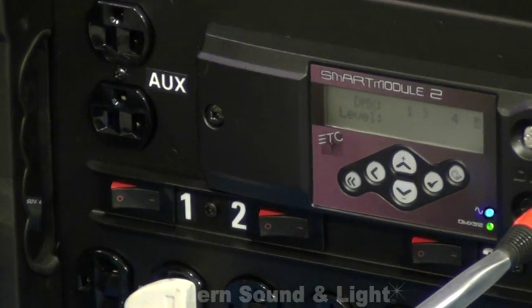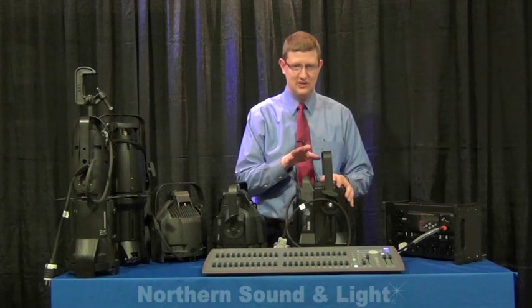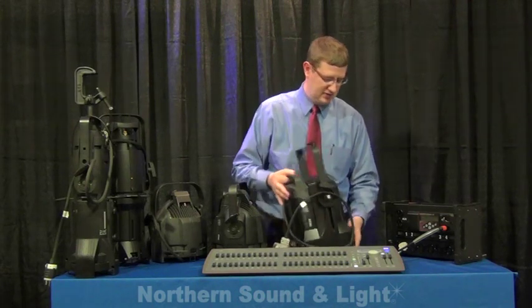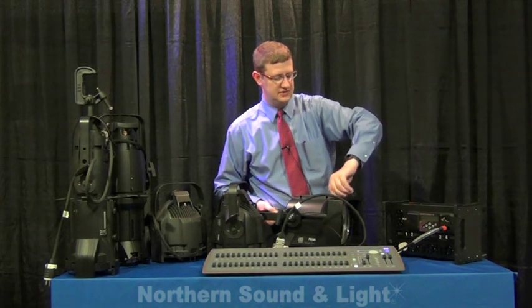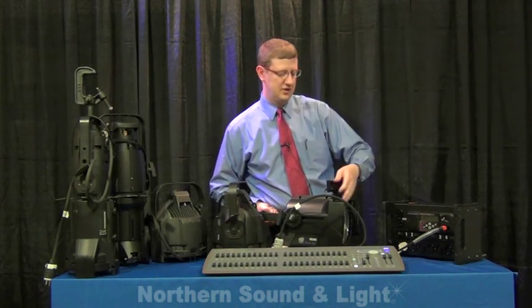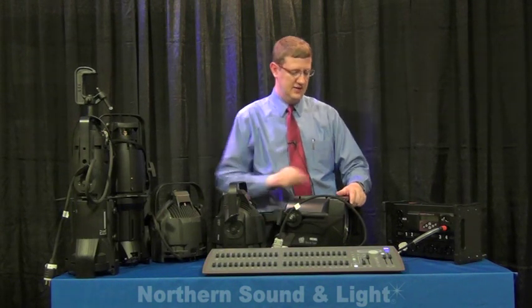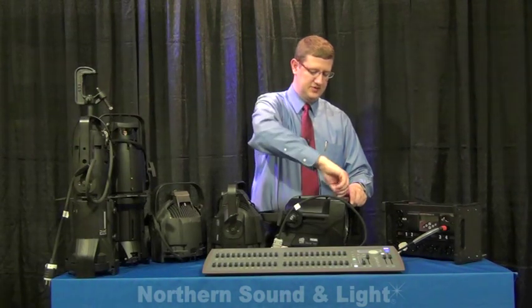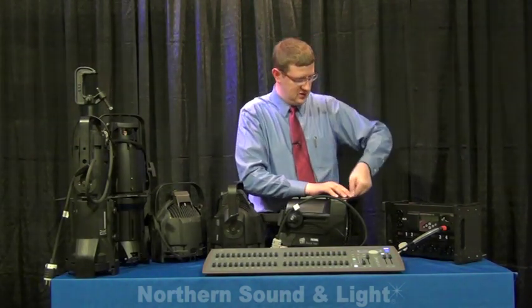We'll start with the newest Source 4 traditional tungsten halogen stage light. That's the Source 4 Fresnel. It's a 7.5 inch Fresnel. The accessories are accessed with this door. Cuts down on light leaks. Your gel frame, barn doors, things of that nature would go in here. And then the door has a couple of spring-loaded latches for securing those items.